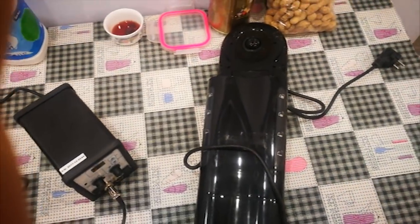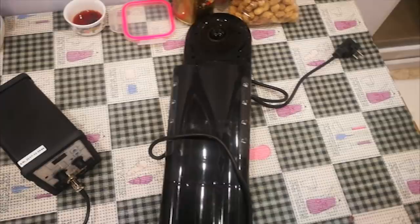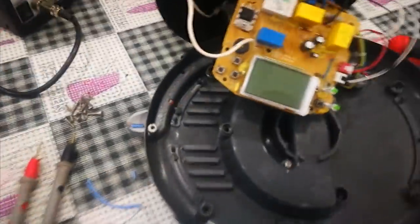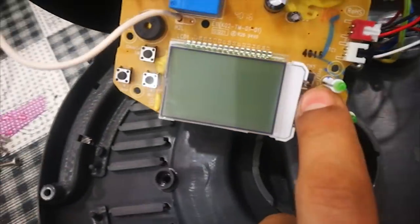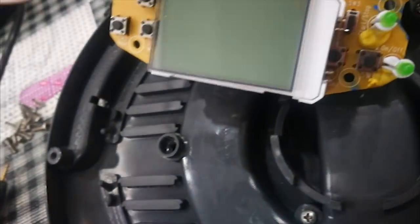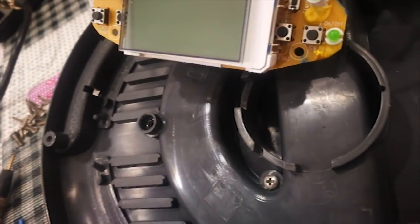What I want to do is start this from outside. Before I come home, I want to make my tea ready. So I will replicate, with Sonoff, me pressing here. How will I do this? This button comes from here to there, and it's actually pressing this small button here. So I will solder two wires, one on one side and one on the other side. Then I will use Sonoff to make a short circuit, and then it will start.